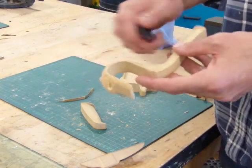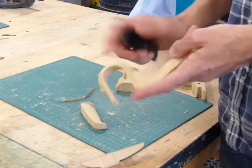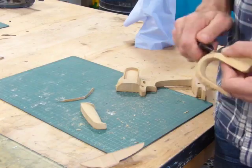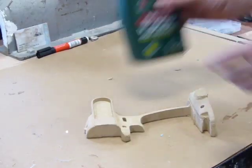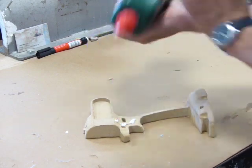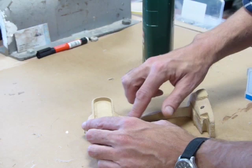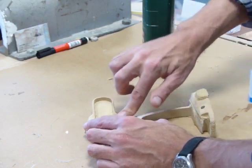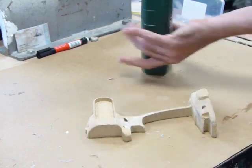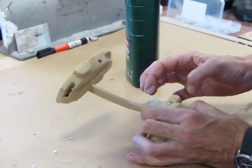And then these surfaces, you can just scrape the fibres away before sanding them. They'll just make it a bit easier, a bit quicker to sand it without taking away any of the form and detail. The MDF will need to have some form of sealer on it. In this case I'm using just PVA wood glue. Just rubbing it onto the surface like this. Just making sure, obviously, I don't leave any streaks, too much in the way of streaks and blobs, because they're just going to make sanding it a bit more tedious.